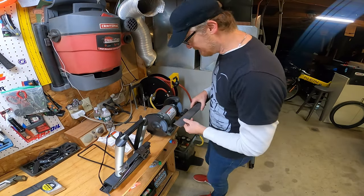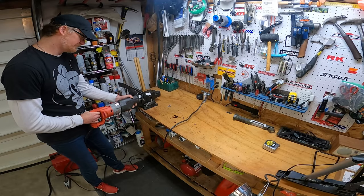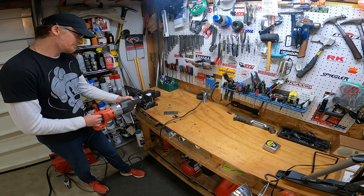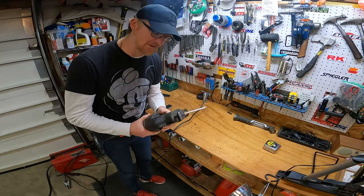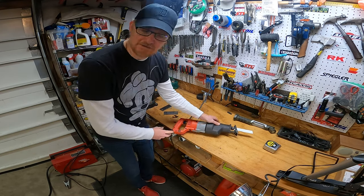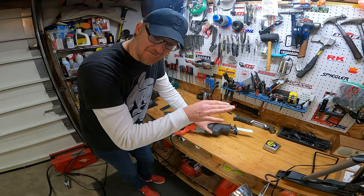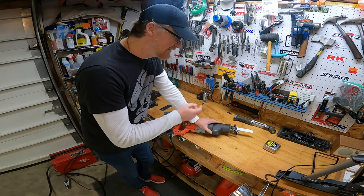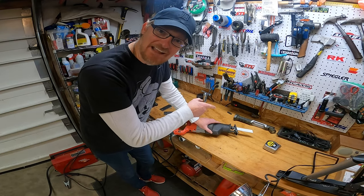It's going to round the corners off a little bit. One thing I had to learn — took me some time and cost me a lot of blades — is slower is better with steel. Speed just heats up and dulls a blade, flattens out the teeth, and then it stops working and you've got to use another blade. Going slow cuts faster, avoids heat.